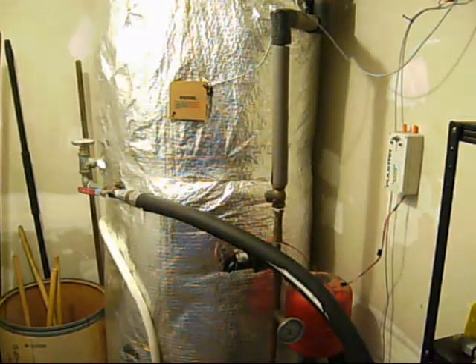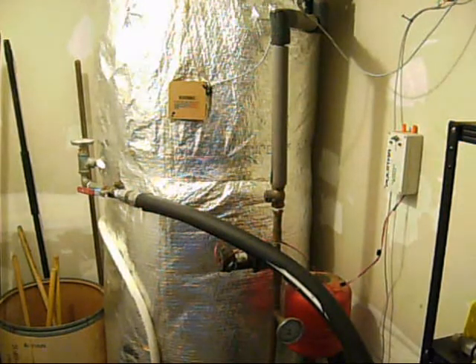The system I've had for probably 10 or 11 years now — I picked it up used, it was 10 to 15 years old when I got it, so this thing is pushing 30 years old. Still runs like a champ. I had driven past this house with this system on it for several years and finally got up the gumption to knock on the door and ask how it worked. He was pleased with it — told me it worked real well for the first 10 years or so, then something went wrong. He couldn't find anybody to fix it and needed to put a roof on his house, so he made me a real good deal. What had gone wrong was the glycol side had an automatic water make-up and it got a small leak — made itself up with basically straight water, froze, and busted several of the pipes. I made some minor repairs to this tank, brought it up, put it online, and it's worked ever since.